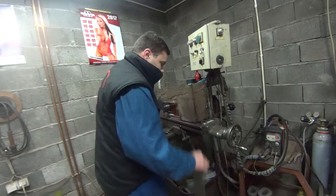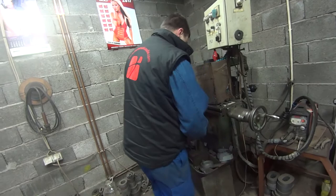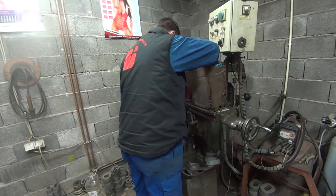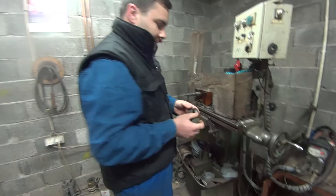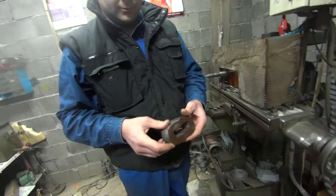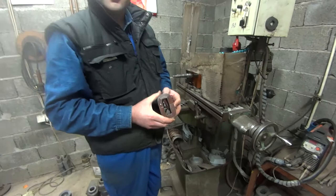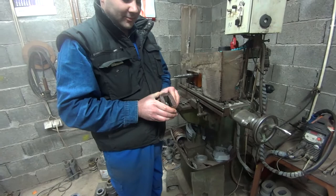So now the core has been cut. Just have to loosen it in its berth. Et voila! What was one is two. And this will be an output transformer for something. We don't know yet. We just know from here it gets vacuumed and resin and baked, and then eventually it'll get a tape and then primary winding, 4,000 windings of copper, and that's just the beginning of your amplifier.